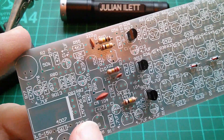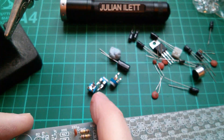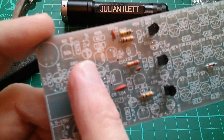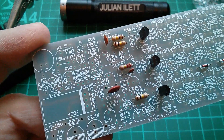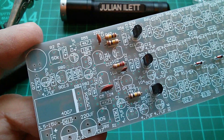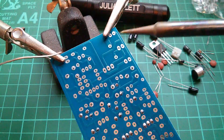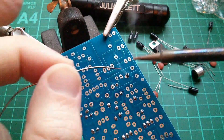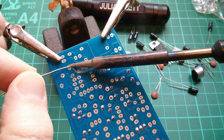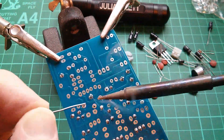Now there are four potentiometers here, all 50k. Potentiometers are normally in round numbers - these are 50k, whereas the nearest equivalent fixed resistor value would be 47k. If you've ever wondered why resistors are those strange numbers, it's because they all fit to a logarithmic scale. These trimmer potentiometers are a reasonably tight fit in the holes, so I don't need to blue-tack them - they're staying in place well. Let's solder all of them in.